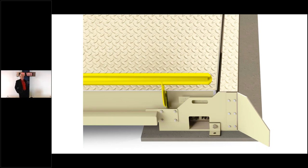Here is the end wall approach that we were talking about a few minutes ago with Luke. This is really nifty. With this end wall design, we took into consideration what you require. At the very top of the side, you'll see where the bracket slips in for the yellow braiding, the yellow cable or the yellow strapping, for loading and moving the scale around. You'll also see below that a larger square area that serves two purposes. Number one, as I said, there are no moving linkages or moving parts below the load cell, but there is debris that gets in there. So that's an area in which you can now clean debris very easily. Or as Luke said, if I'm going to make a quick load cell change, that is also an area where you can slip a jack in to raise up that end module and replace that load cell.